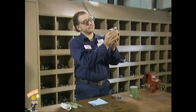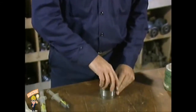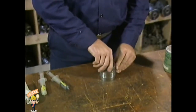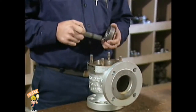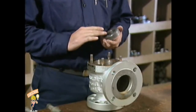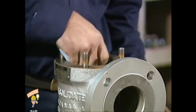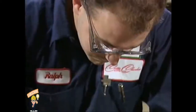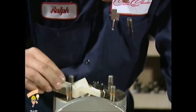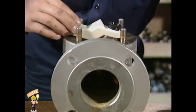Also check the disc for steam cutting. If steam cutting is severe enough to allow leakage, you'll have to replace the disc. But if the damage is relatively minor, you can often restore the surfaces by lapping, using the appropriate lapping method for the shape of the disc. If the seat damage isn't severe, you can probably restore its surface by lapping as well. When you're done lapping, clean all traces of lapping compound off the valve seat and all other internal surfaces, then wipe any remaining residue off with a clean cloth. Use a light or bluing to inspect the clean seat for any nicks or uneven spots, and repeat the lapping process until the surface is smooth and even.